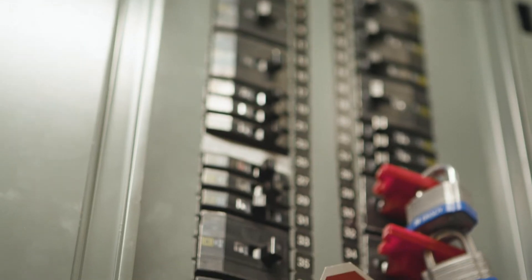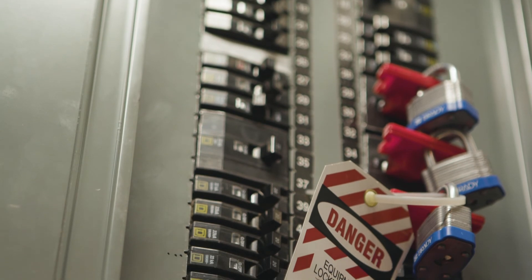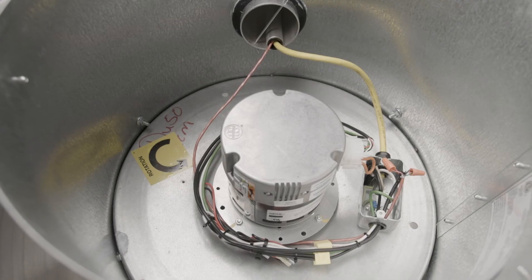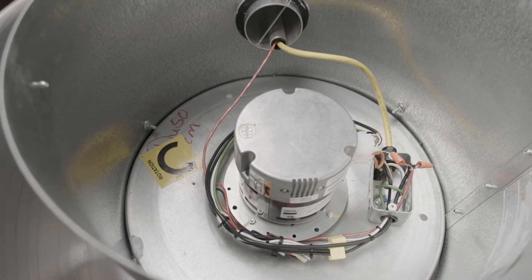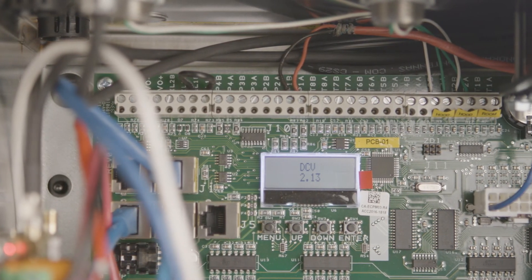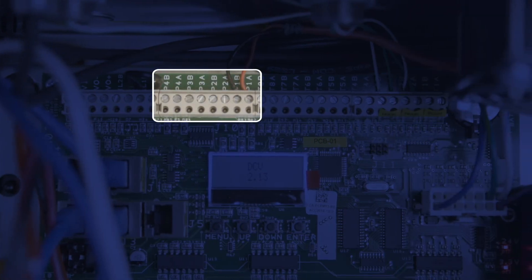Now let's look at how to wire a fan to our hood control package. Start by wiring the high voltage for the motor straight to the breaker so the fan will have standing power all the time. Then locate the low voltage wires in the J box of the fan and wire these with twisted shielded pair to the hood control package and land them on the correct P terminals.